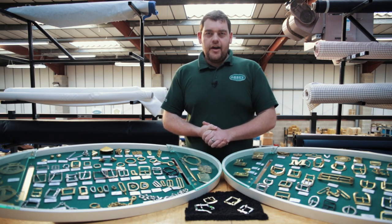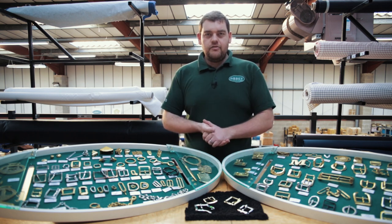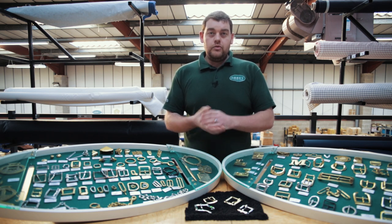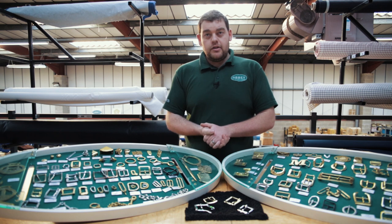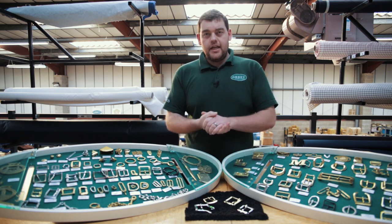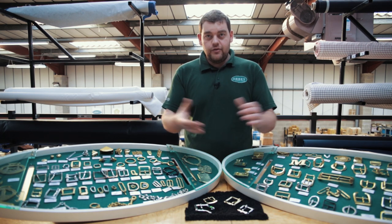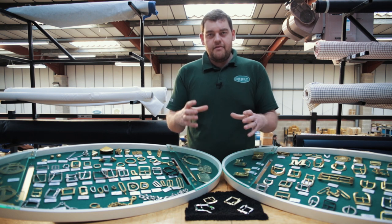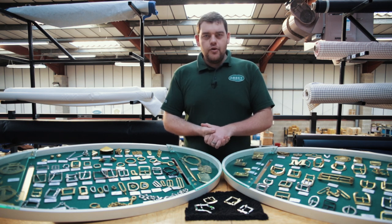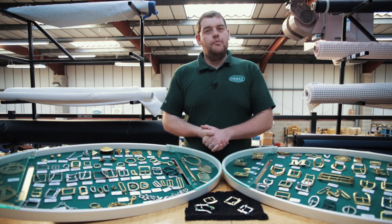It's done in an oil-fired furnace. The crucible is then moved over to a section of the foundry where then they pour the molten brass into the mould or the pattern, which is the box. Then the box is allowed to cool, and then the final process within the foundry is that then they knock the box apart, which all this sand falls apart, and then you're left with a very, very rough buckle or fixture or fitting that then is then moved on to the next stage, which is either barrelling, filing, or polishing.